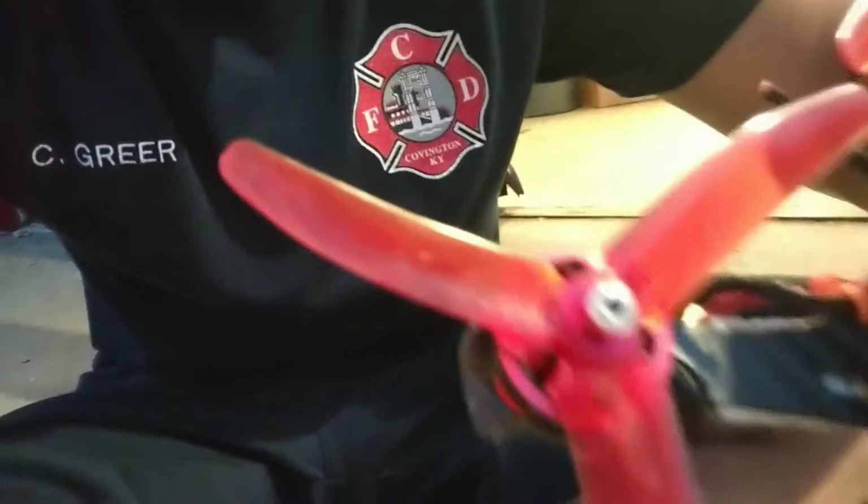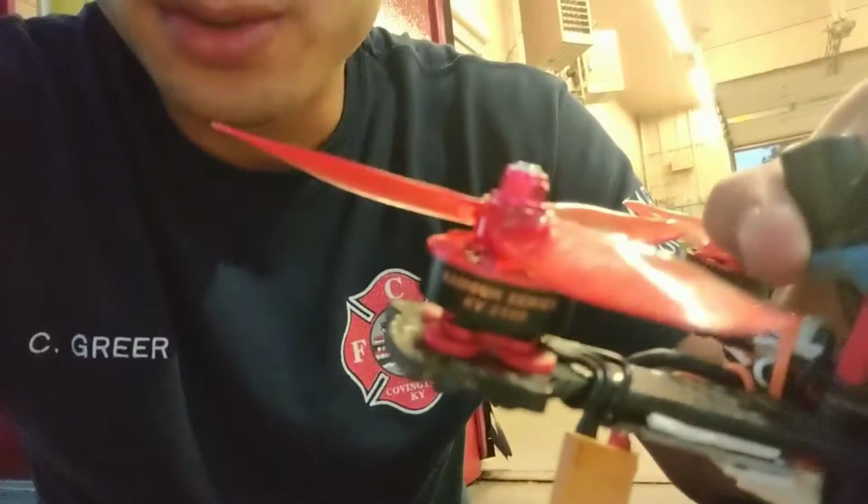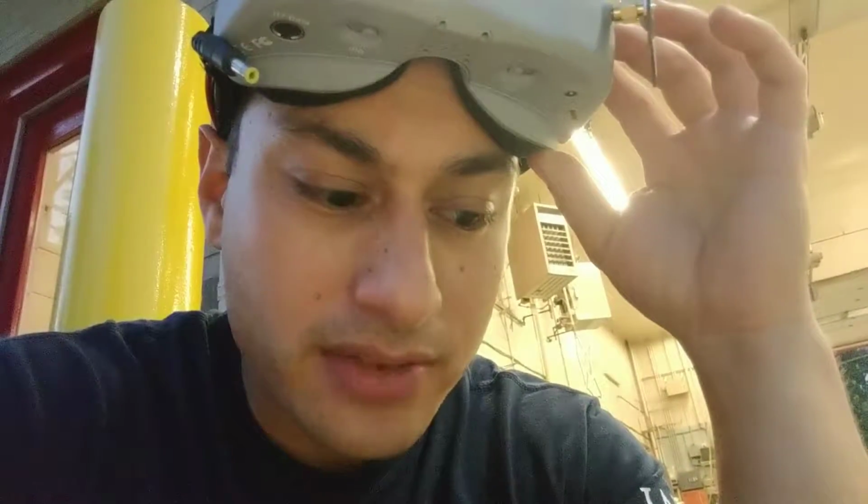They are wound to, I can't really see. If I had to guess, I think 1600 kV. I have no idea. Wild guess. Everything that I've seen was close to that, that I could count from pictures on Pyroflip's page and from everybody else with close-up pictures of the motors, trying to count winds on the poles to reverse engineer my own winds.